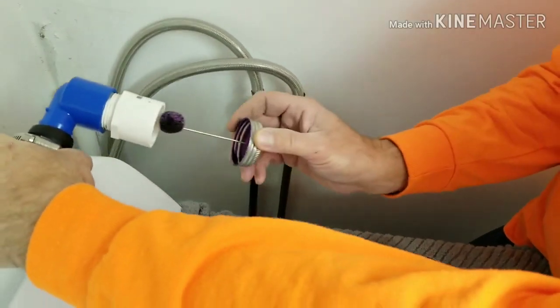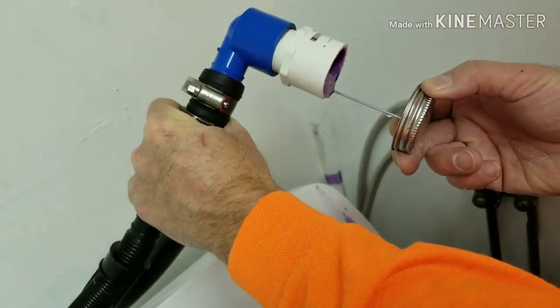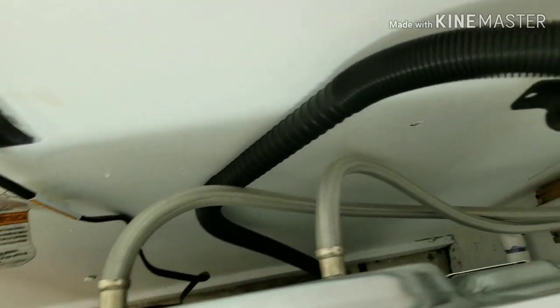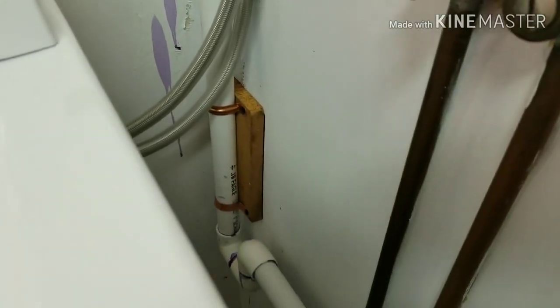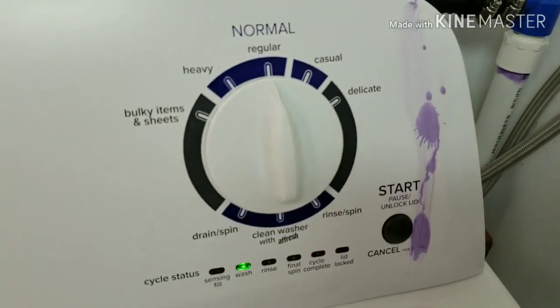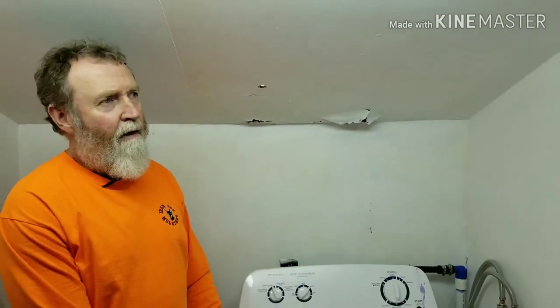The last task we have is to glue on this adapter — now we are priming the top of the drain pipe. Everything is connected and we are going to test it now by doing a load of laundry. The washer just drained and we have no leaks, so I am going to call it a success — except for the purple primer stain. For our next video we are doing some drywall water damage repair, cutting out the old damaged drywall and replacing it, taping it and painting it, and completing this laundry closet.